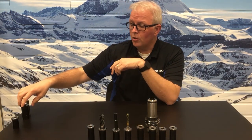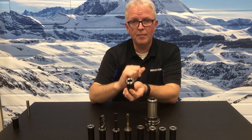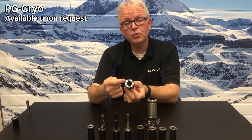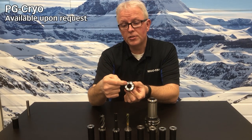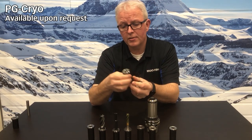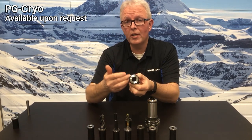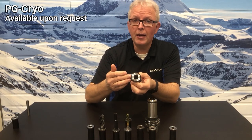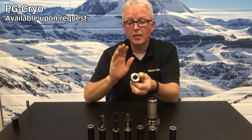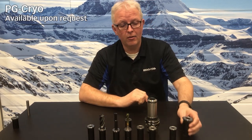While we're talking about coolant options — I know this is a PG-32 rather than a PG-25, but it is the sample I have here available. This is a cryo collet, made for CO2 lubrication. Instead of having the large slots like on a regular coolant flush collet, this one actually has very small slots. The slots in this will range from 150 microns up to 250 microns, and the number of ports will be dictated by the customer and the application. Not a problem for PowerGrip — the correct series collet would drop right in just the same.